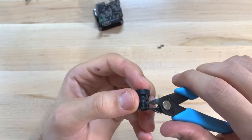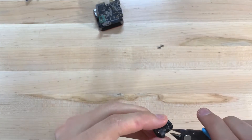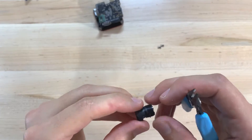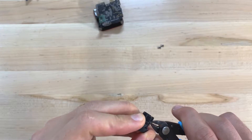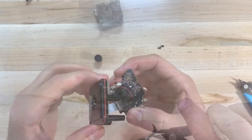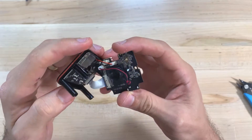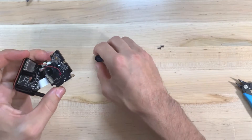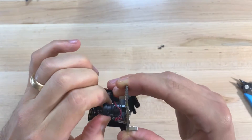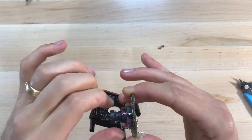Once you have the lens free, grab whatever tool you have on hand to remove as much glue as possible. If you're going to use a wire snip, just be very careful not to damage the threads as they are very fine and can easily be damaged. You won't be able to get all of the glue, but that's totally fine — we're just trying to get as much as possible so that we can freely adjust the focal length of the lens later on. You're also going to want to check the threads on the image sensor to make sure that there's no glue left there. Next, screw the lens back on. I recommend screwing it all the way down until it feels tight, and then work it back and forth a bit to break up any remaining glue in the threads. This will allow for smoother adjustments of the focal length later on.